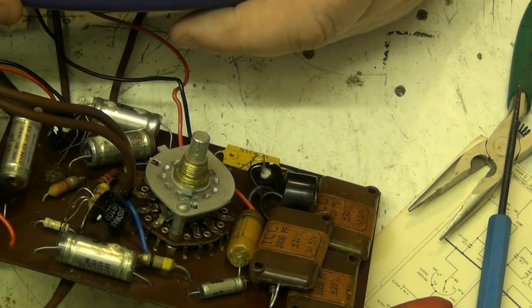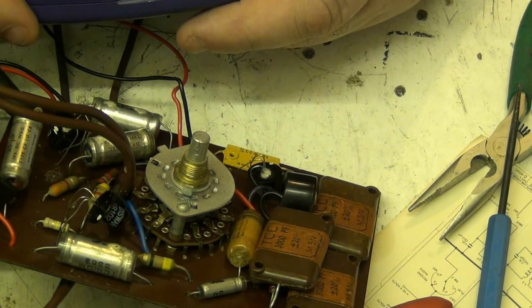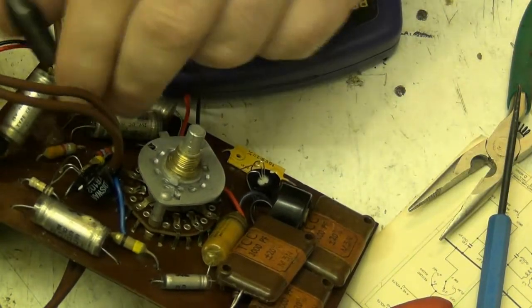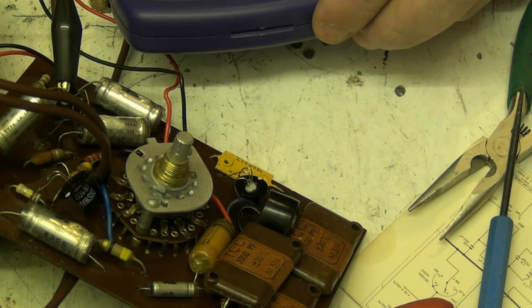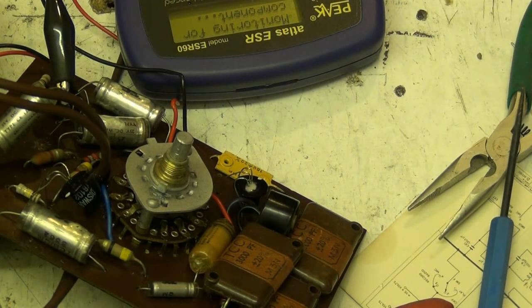Now let's have a look. That should be 25 microfarad. It's monitoring for components. Let's make sure that's monitoring for component. It's analyzing open circuit and low capacitance. Let's try again. Monitoring for component. So let's get my box of capacitors out. No wonder it sounds like shit through the mic. Right, get me box of capacitors, because I think they are.